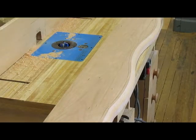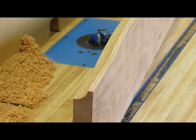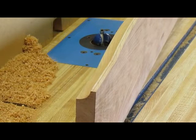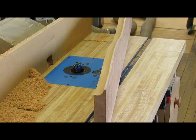There's a first pass with the core box bit, and then I'll just keep raising it until I get it to the correct height. I've had about six passes, taking a little off each time. You can see I'm getting close to my line there, which is where I want to stop for this particular molding shape — one or two more passes to sneak up on the line. I've got my 3/16ths on the bottom, and now I've got to change out the bits and use a rabbeting bit to add my 3/16ths step to the top.